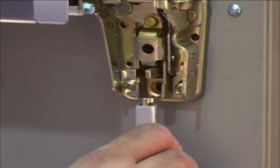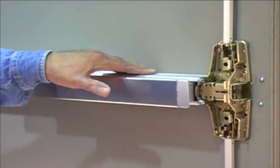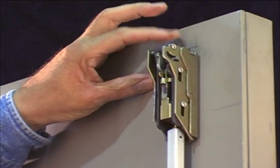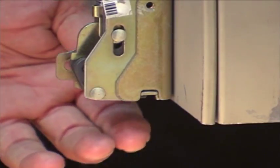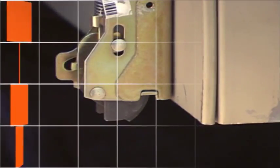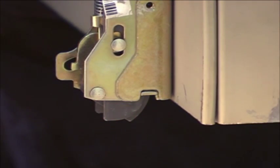Reattach the bottom rod by inserting it into the center case assembly. Cycle the door again. Check the top latch to confirm that it remains retracted and dead latched. Then examine the bottom latch bolt — ideally, it should be flush with the bottom of the door. If it extends more than 1/16th of an inch below the bottom edge of the door, you will need to adjust it.